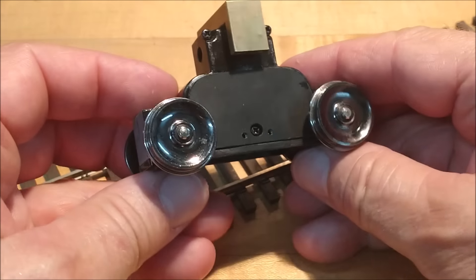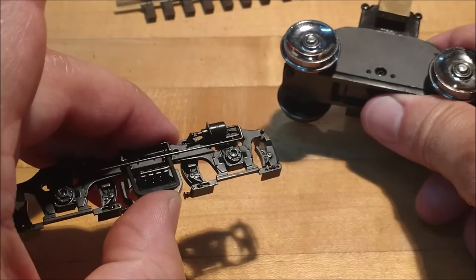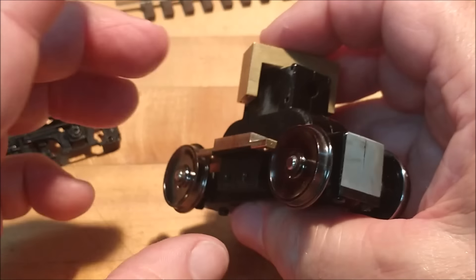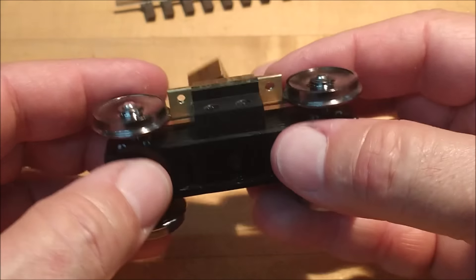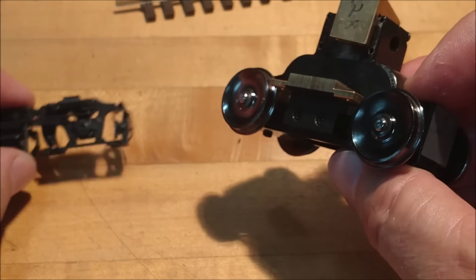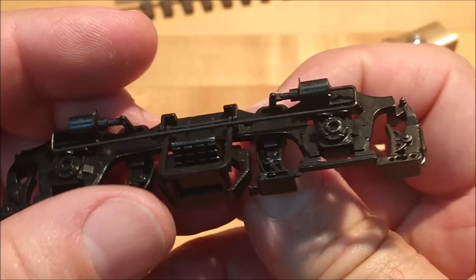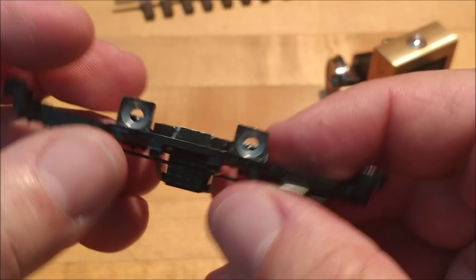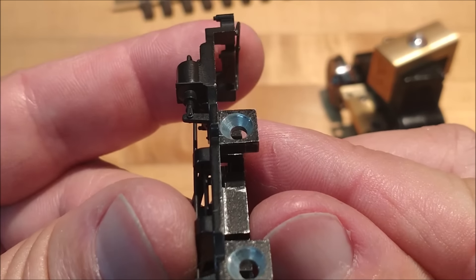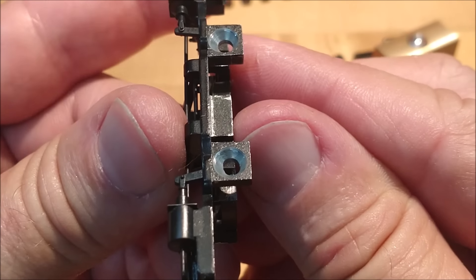Today's project is picking up on something that was said to me. What we're looking to do is mount this component right here to the side with some degree of integrity. The parts were supplied with some of the work done — I've tweaked it, and those tweaks are valuable. One of the things that needs to be done to this particular component when it comes in is these holes are threaded and they need to be drilled out. The threads need to be drilled out and countersunk with some degree of integrity. You can probably see that this particular countersink is not exactly true to the hole.